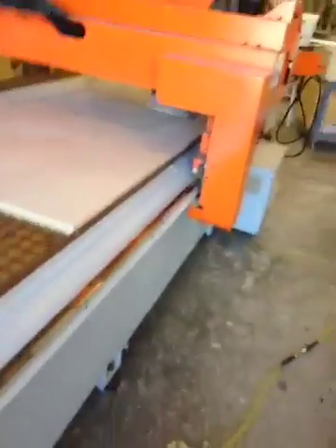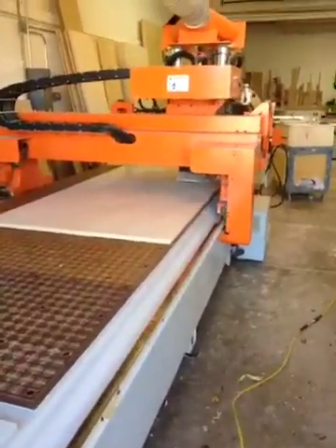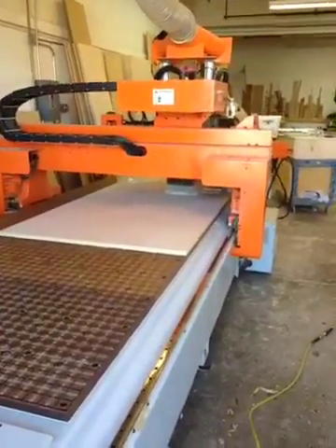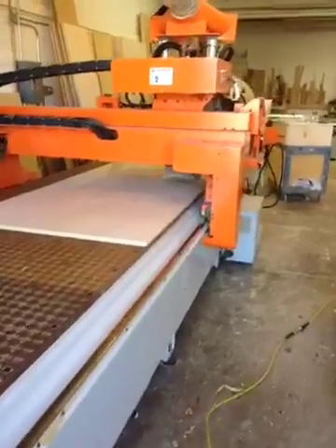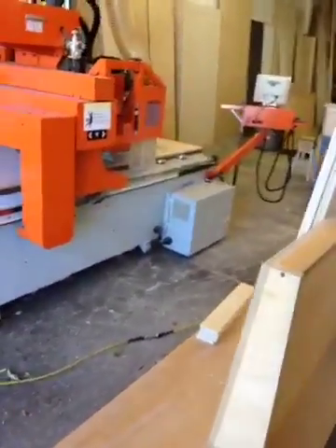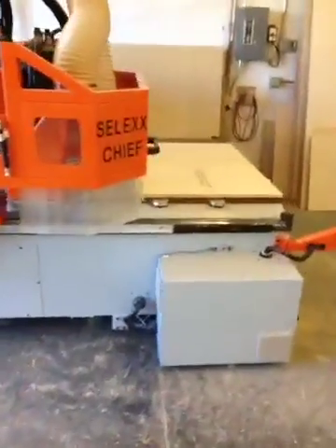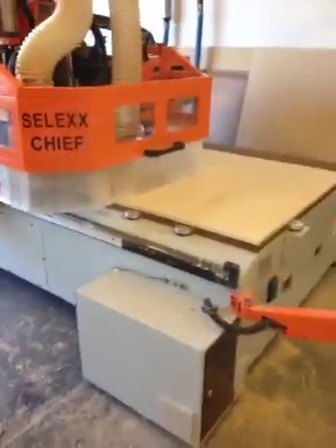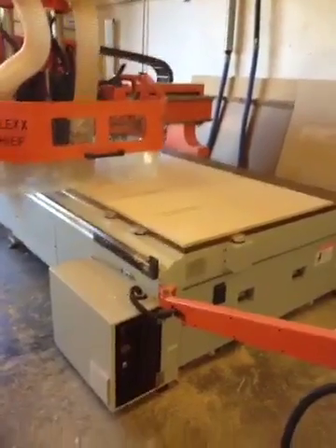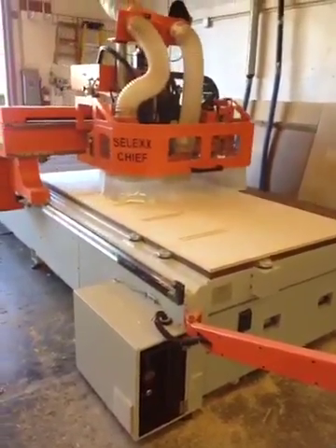That's how we can get any size dado with a half-inch bit. It goes back and forth twice with a little bit of movement in the long axis — the Y axis — in between those passes. There's quite a bit of dadoing on the top of this part. There are two thick shelves right next to each other, and it's going to be built up to a two-inch solid-looking shelf with a little half-inch space in between.